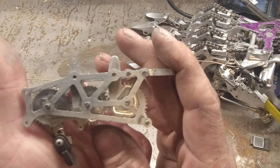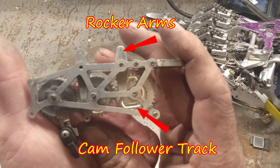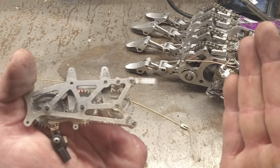As the gears rotate, it moves the cam followers and rocker arms forward and backwards to pull and push onto the cable, releasing and catching the fingers in the grip pattern selector assembly.